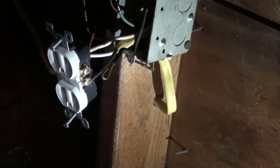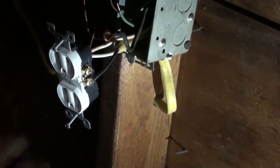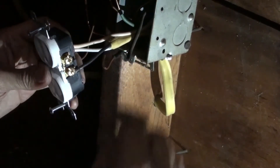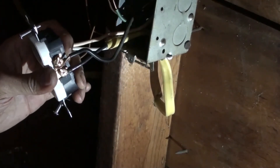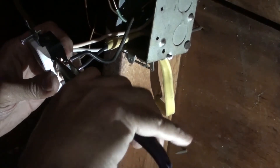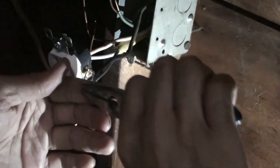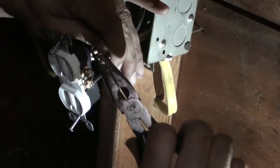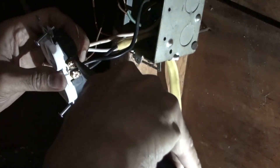We're looping it clockwise because I'm rotating clockwise — you have to loop it the same direction as the tightening. I'm going to open this up a little bit to get it in around the screw. I think this might be a little too long — I don't want exposed insulation sitting there, so I'm going to cut a little bit off, twist it around one more time, make a bigger loop, fit it around, and now twist it in place.